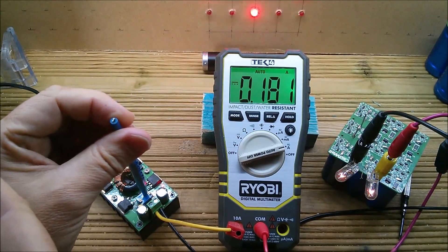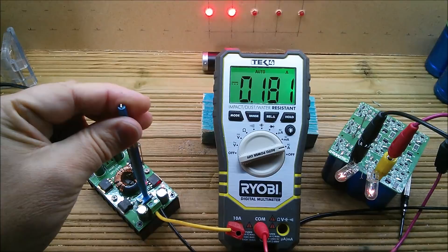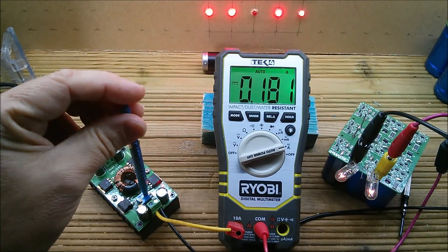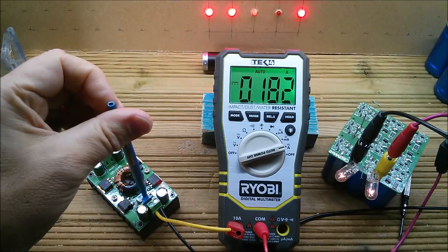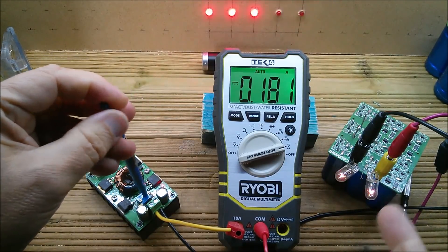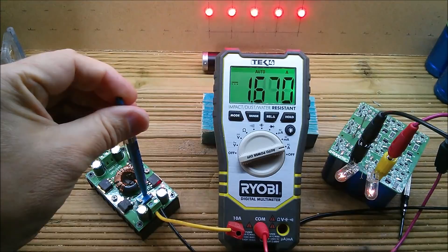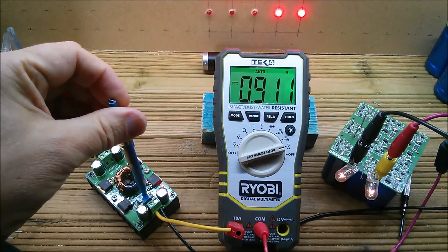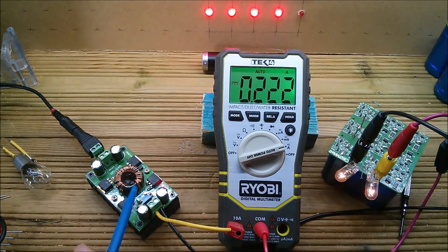I've been turning the power bank on and off and it keeps erroring, seeing more than three amps — so maybe there's a surge current. Even when set under one amp, it's triggering. Once the voltage gets to four or five volts, 180 milliamps does seem to be the minimum current, and that shoots up pretty quickly when you raise the pot.